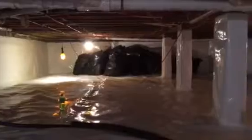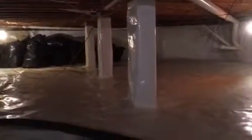I'm coming back to do the 30-day inspection in a little while. We are going to insulate the band joists, but after that dehumidifier has run for 30 days or so — we're pretty close to saturation in here. You come in here and break into a sweat almost immediately, and now it's dry as a bone. Everything in here was wet.